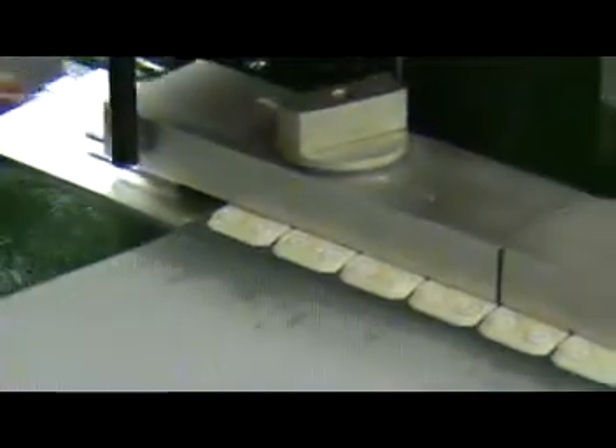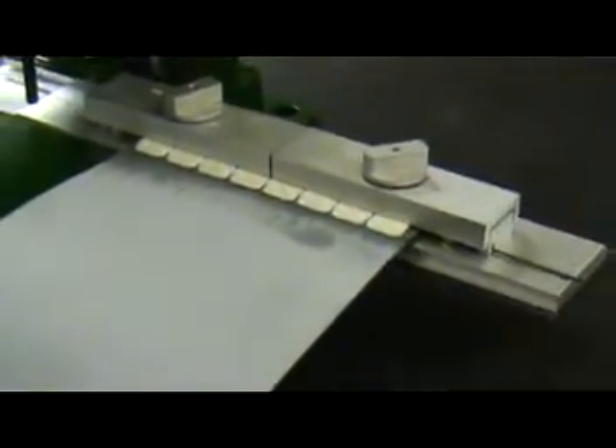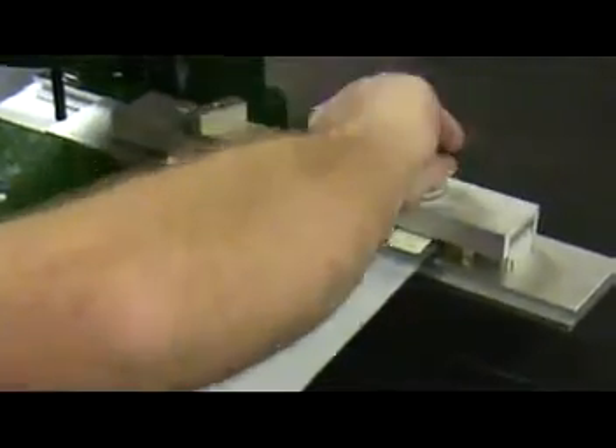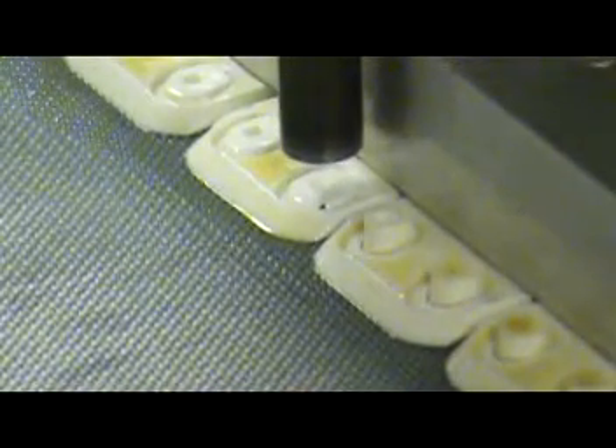After curling the last rivet, slide the comb assembly out. Remove the gauge pin, loosen the clamp screws, and remove the belt. Repeat these steps for the second belt end. For belts wider than the comb assembly, repeat the preceding steps across the width of the belt.